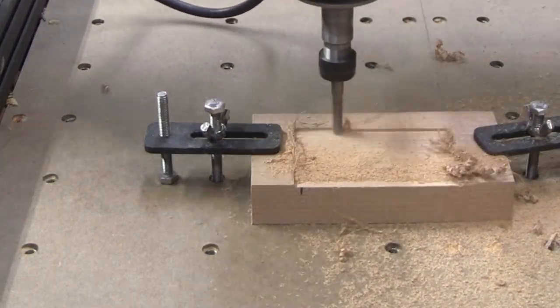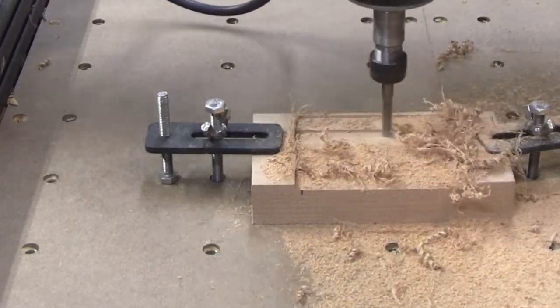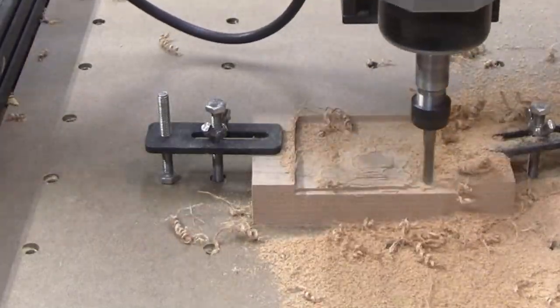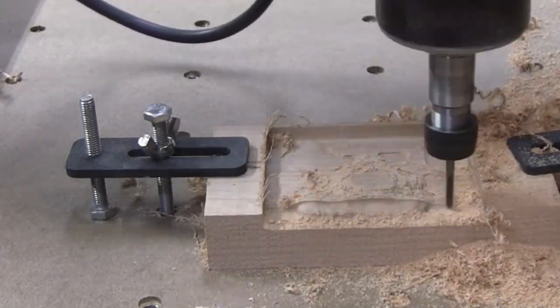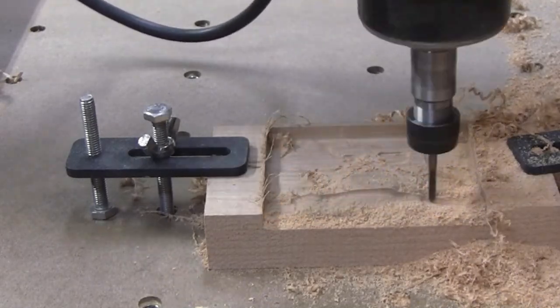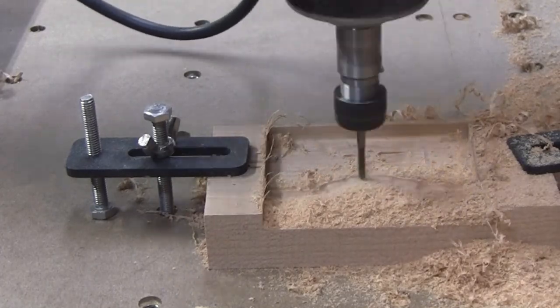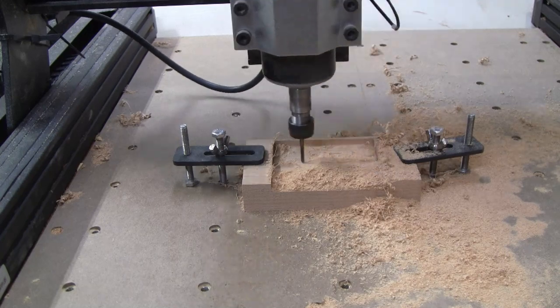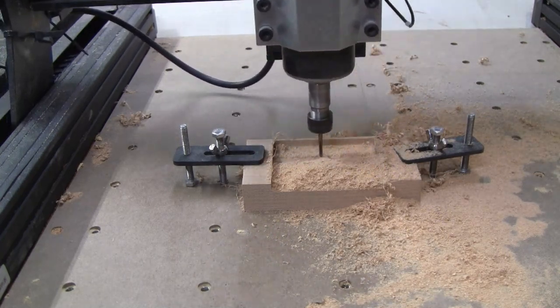I'm running this at a pretty fast speed — otherwise I'd need to cut a lot of video out of it because it would be really long. I started the machining with a quarter-inch flat router bit, carbide, and I've now switched to a one-eighth ball nose carbide cutter. Once I trusted the machine to do what I asked, I would just start it and go do something else.